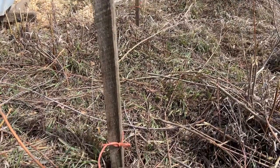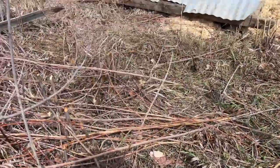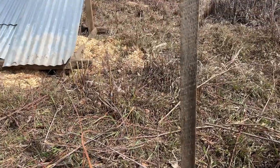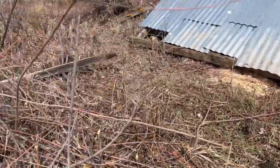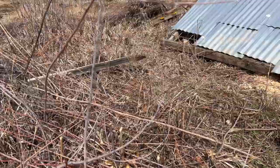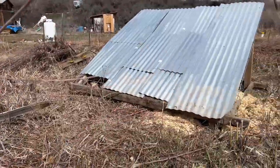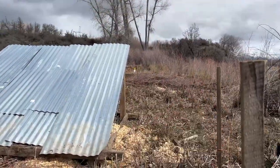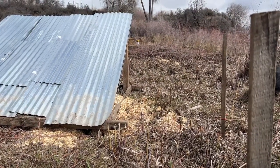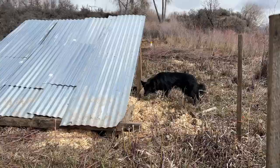In this case I've doubled those numbers. We have 6 feet or 72 inches between these two stakes, which means we'll need this run to be 8 feet and the hypotenuse to be 10 feet. Where those two lengths meet will be the exact placement of the corner. Then we'll have a square corner and we can measure everything off of these sides in parallel, so we'll have a nice square pig pen and all of our panels will be long enough and won't come up short.